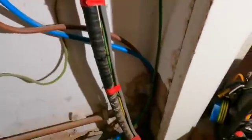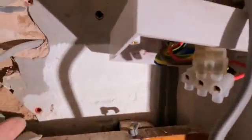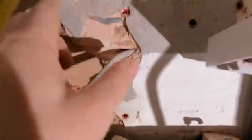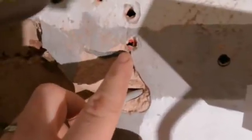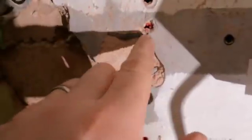Right, so in here - I think what they've done is they've gone down here and then put a new circuit in like the dining area, and then they've brought it up to this bit and extended it. That lower one is this one here and then it runs up this way. So I'm going to unpick that - you see how close that drill is to that red Rawlplug there - and find out actually where it goes, whether it loops back up into here, because someone's already chiselled that out.